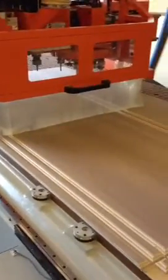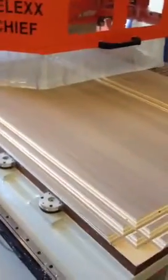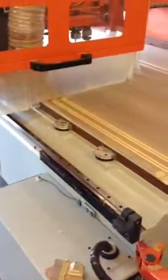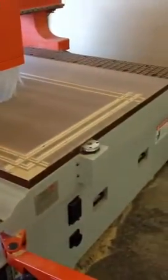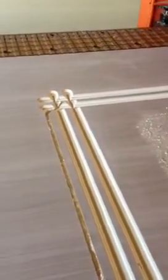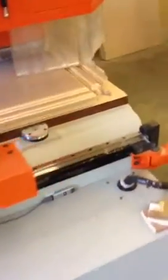This is fast-forwarding. All of the miter folding is done. You can see the body of the tabletop, and there are two folds on each side of the top. Right now the machine is outlining the part, cutting it to size. In the corners, it's making a 45-degree cut, which is putting the 45s on that inch and a half return that's going to be parallel with the top. All those two parts fold over, and then there's the 45-degree joint that's going to make up that inch and a half return.